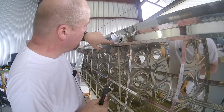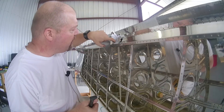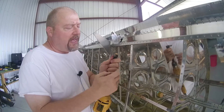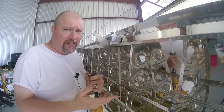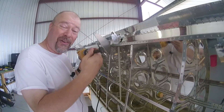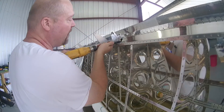I've got the one drill done. Now I'm working on the other, and the trick is countersinking this guy. If you're not real careful, it's easy to chatter on these holes, especially with this particular aluminum. I find going slow is the key. Another way to get around chatter is they make some of these countersink bits that have 3 teeth, 4 teeth, 5 teeth, all the way up to 6. Sometimes getting one with more teeth helps — I am told. I only have the 3, so I don't know if a 4, 5, or 6 would help at all. But this works — it's just you've got to go slow. It's very easy to go too fast.